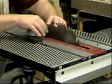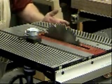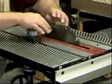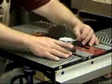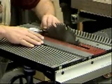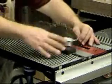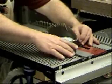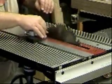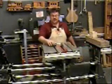So let me go in just up, not too much. There we go. Yep. I'm just bumping the sides of the table here. We go on 0 there. And we're on. Okay, a little too far. One more time, guys. Ah, that's it. Okay. We're on 3 thousandths here, and we're on 5 thousandths here. That's a 2 thousandths difference. You can't get much closer than that. If it's within 5 thousandths, it's going to be absolutely cool.